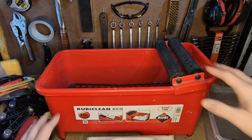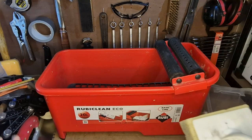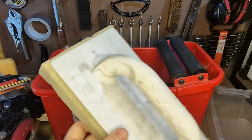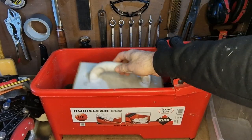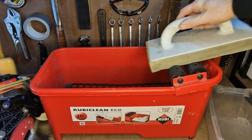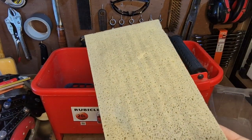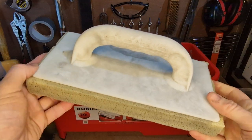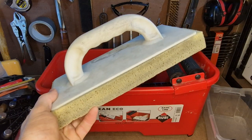The Washboy here — if you've never used one before: you've got your grout on the wall and on the tiles, and you want to wash the grout off. The old way of just getting a sponge, sticking it in a bucket and squeezing it out every time is a lot harder. With one of these you just stick the sponge in the water to wash the grout off and roll it down. With this particular one you've got to give it a lot of rolls to really get it dry, but once it goes a little bit dry it just cleans so quickly. It was only cheap and it pays for itself in no time.